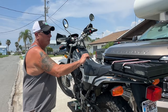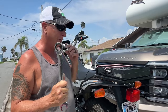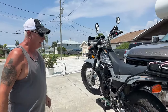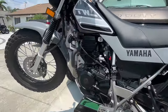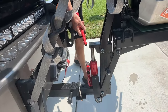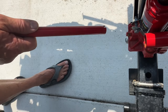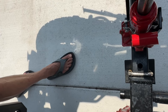The only special tool I didn't have in my toolbox was the 25-millimeter wrench. It was $22 on Amazon. We went to Harbor Freight and you had to buy the whole set to get it, and we weren't going to spend $150 to do that. To take the bike off, you basically lower it down over here using the standard hydraulic hitch. You undo the valve — lefty loosey to lower down, righty tighty to raise it up. Before we do that, we're going to take a cut and take off these straps and come right back.